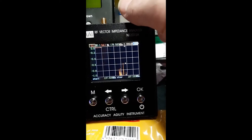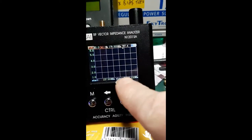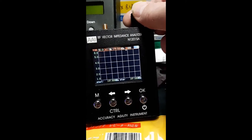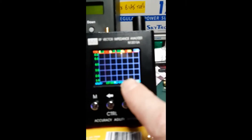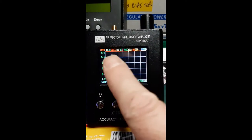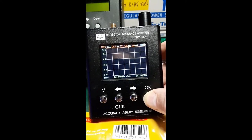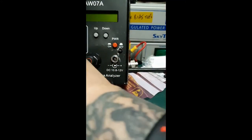The important measurement is the VSWR. Once you've got it where you want it, go to your marker, highlight it, and there's a little yellow tag that moves up and down to show you where your resonance frequency is. Great little bit of kit. They don't break the bank, they're worth every penny, and they go right up to 2.5 gigahertz — which is what I want because I use 13 centimetres on the QO-100 satellite.